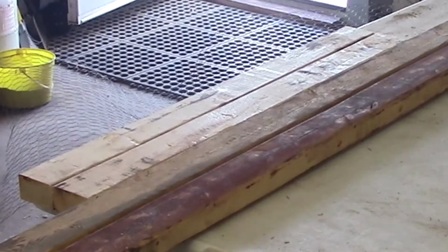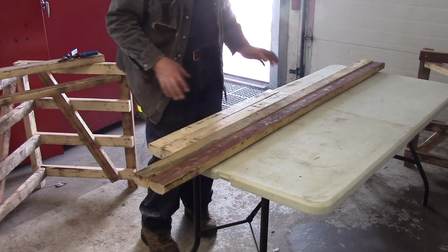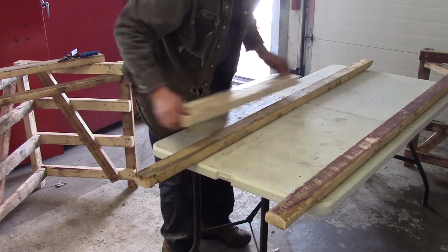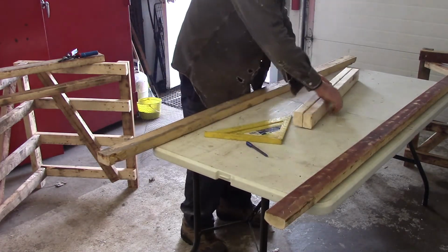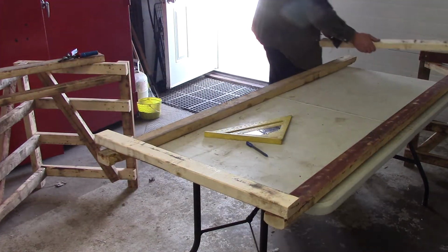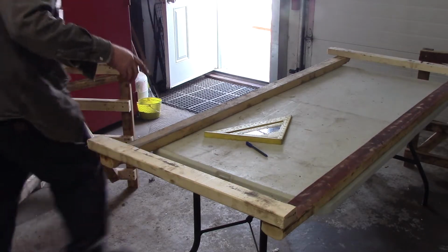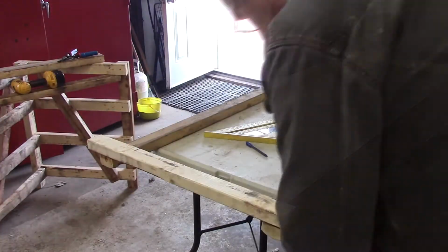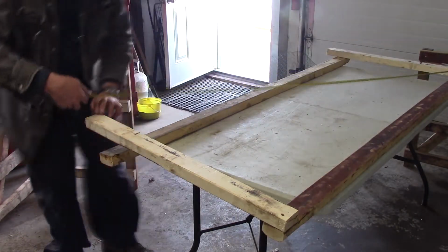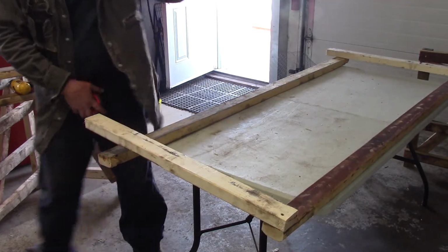I've got these measured off where I need to. I'm actually 1/2 inch shorter than the original corner post, just because of height of grass and all that. But so I'll find a somewhat of a good edge. Okay, let me just screw those in the 2 corners. That way they hold themselves and I can put a tape measure on. So I just want to be able to square this. 78.5. 78 5/8. So right there is kind of good square.